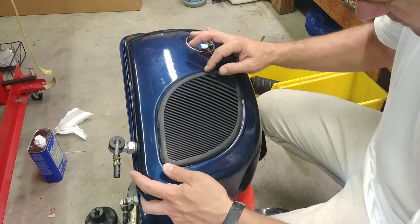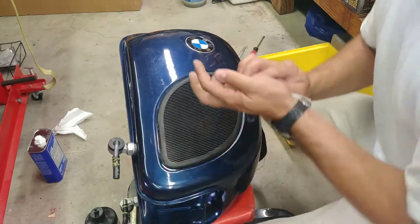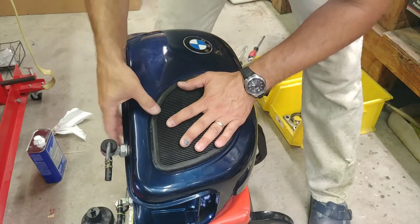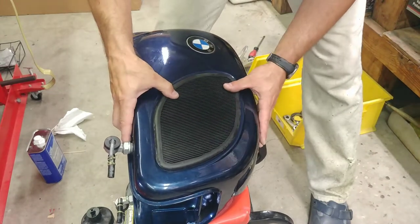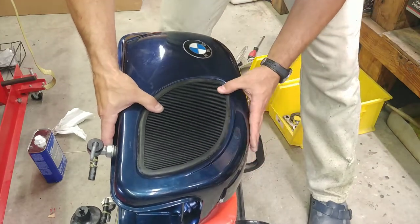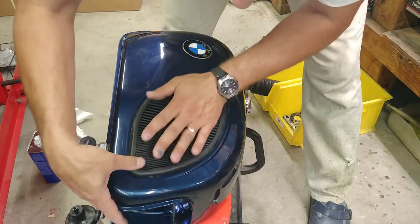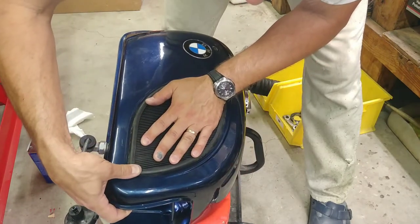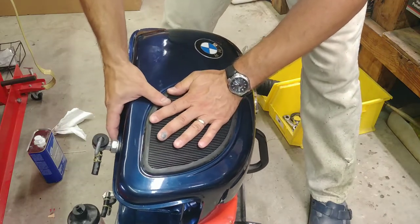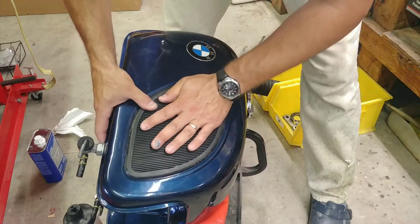There is a little bit of smear out here and there because I'm pushing it around too much. If you don't wait too long with the clean up, you can remove it with acetone. But then at the same time you have to be pretty careful with your paint — here in this case it's powder coat. Powder coating is relatively resistant to chemicals, you just don't want to rub too long.